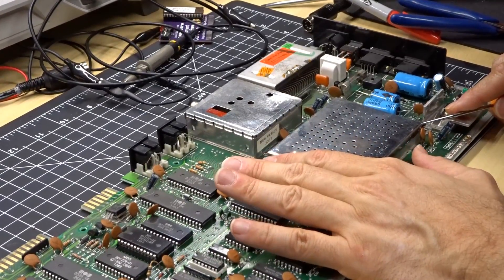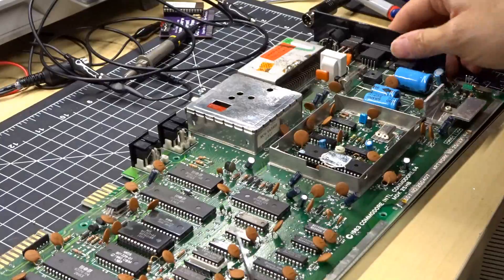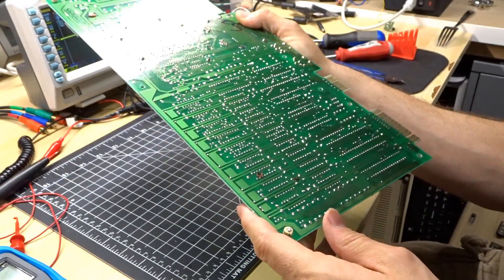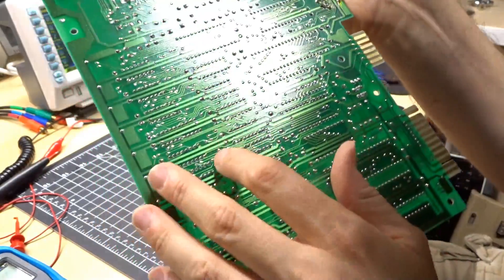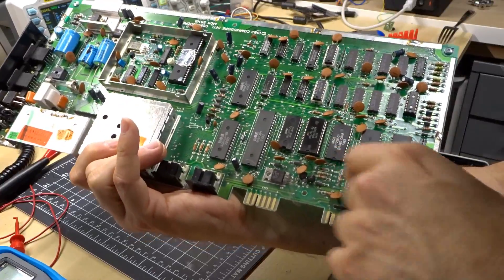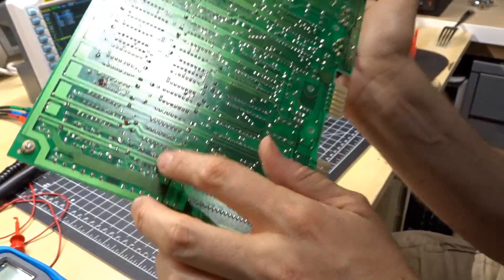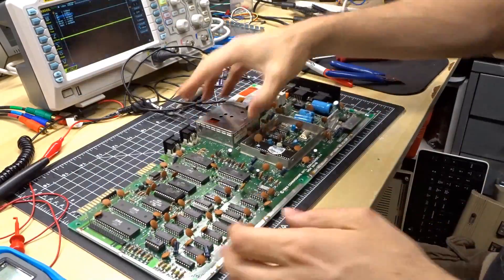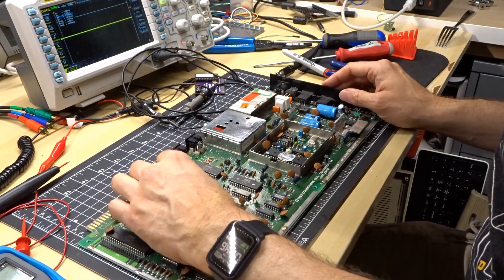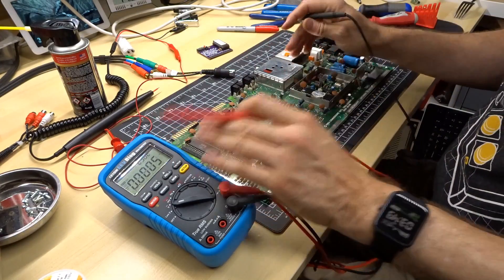Let's get the shield off. These are easier to take off than the other ones. At least there was a little heat sink compound on the VIC chip. When we flip this over, whoever reworked this cleaned up after themselves — the two sockets were installed and I really don't see any evidence of prior work on the board. There are some cobwebs, but that looks pretty much perfect. Whoever worked on this, whether at the factory or not, did a really fantastic job — there's no flux residue on the bottom. Let's power this up and do some quick voltage checks.